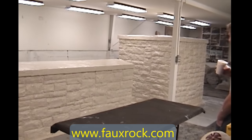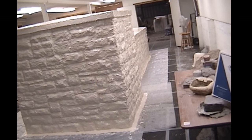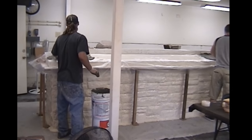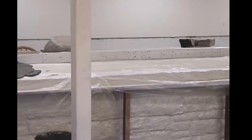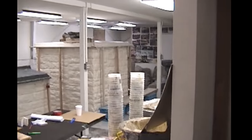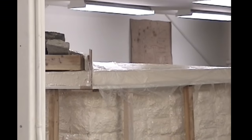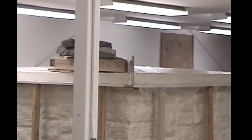The left box, this long 15-foot by 3-by-3, was done in five pieces, where the big box took 6 pieces. Now, here we're just forming up the 2 half pieces on the top of the long box. One that you can see right here that the guys are actually making. On the other side of this flange that I'm getting up to, you'll have another half. So it's 2 halves on top, and on the top of the big box, again, a 2-piece hard mold will give you a release. So we've got that being formed by that little cardboard and wood form on that side with a bunch of material to hold the weight so the form doesn't move. So we're going to cast out.